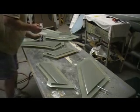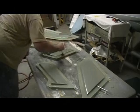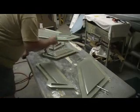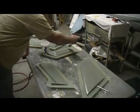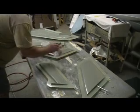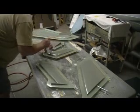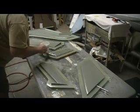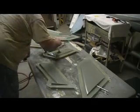So someone wants to know why I don't use a respirator when I'm doing this epoxy. That's why — because it's epoxy, not polyester. This resin from Associated Industries, I can't even smell it. Now the resin Butch uses has a little odor to it — smells kind of like enamel paint — but this stuff has real low odor. With polyester, you better have not just a dust mask but a real respirator, like scuba-type stuff. Polyester is bad stuff.